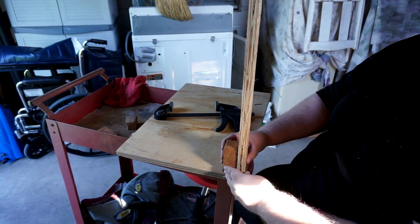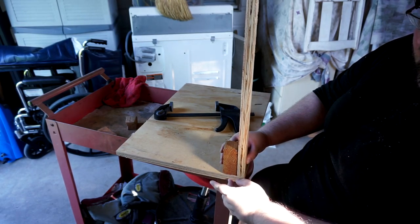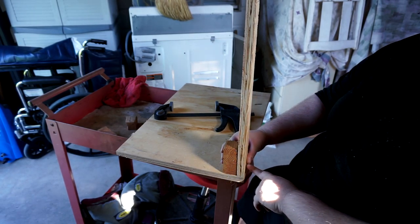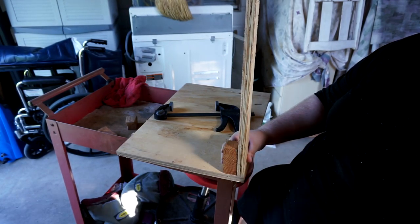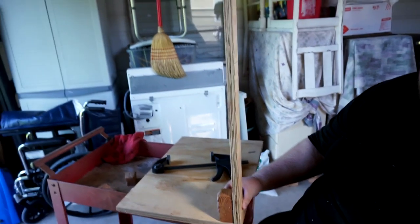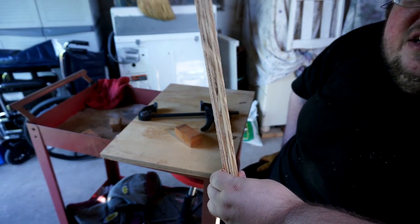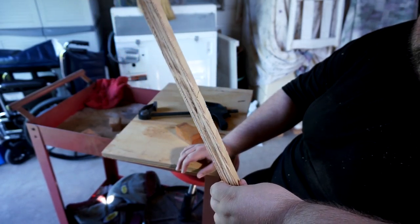So it's going to look sort of like this once it's done. This will be glued here, and then this will be glued to this and this, and I'm going to let this sit overnight. Then in the morning, put some screws here to give that final support. These are the legs, so it's upside down right now. You may be asking, why am I using three-quarter-inch plywood?